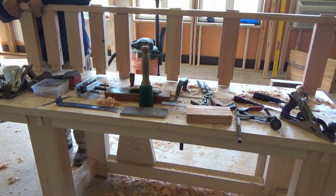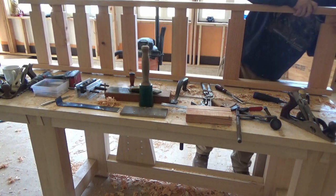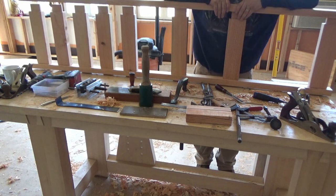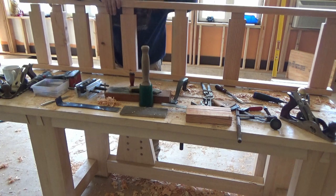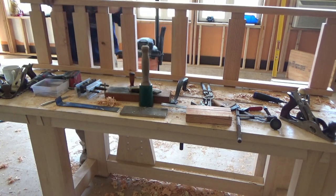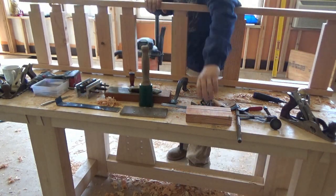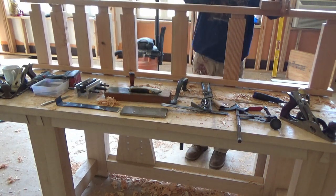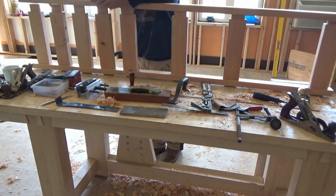The next frame, as I flip this over, takes some more work to get together, because I'm not putting the tenons in individually — I've got a staircase arrangement, so on this side I had to use a block and gently press it, or I could have used a clamp as well. The camera makes it look like it was pretty hard to get together, but it really wasn't. It was just a matter of too many tenons all working together creating resistance to pulling that piece together.